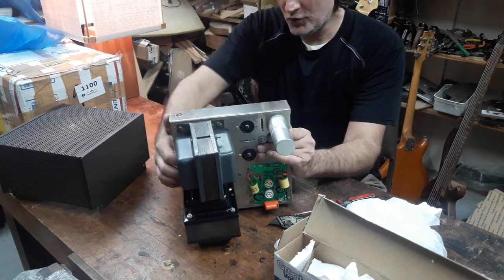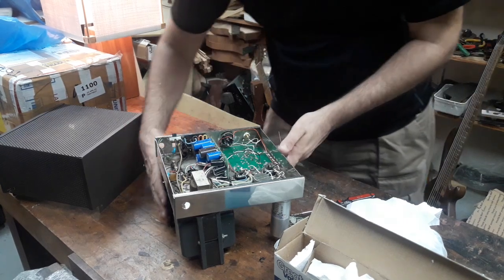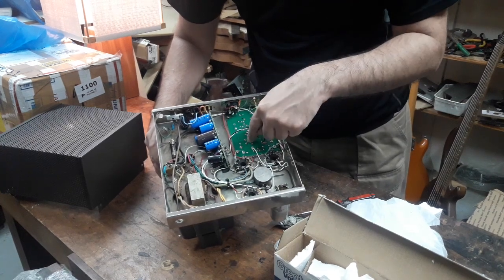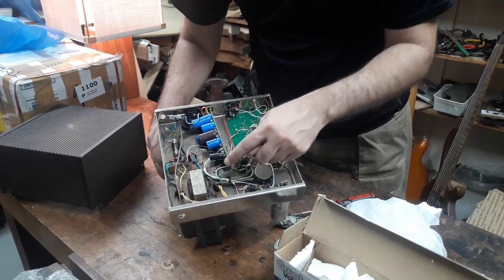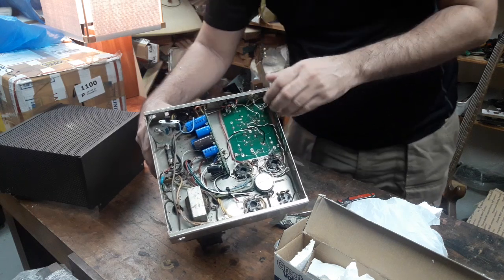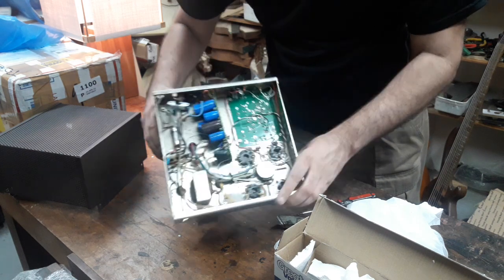And I'm really not sure which one needs restoring. I think this is the restored one. It's not fully restored. They're both sort of at a kit stage of completion. This has an upgraded power supply board and an upgraded phase inverter driver board, stock choke and switch and fuse holder, octal socket is stock. Actually, this may be, wow, this may be a factory wired amp.